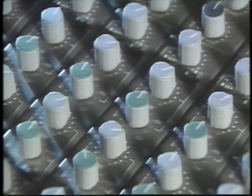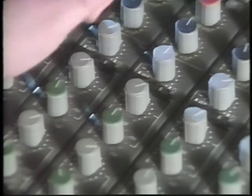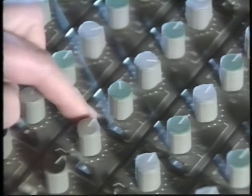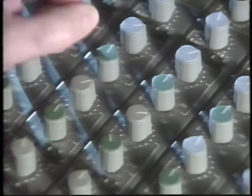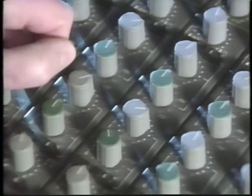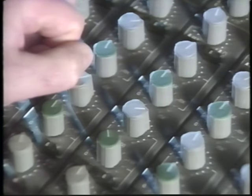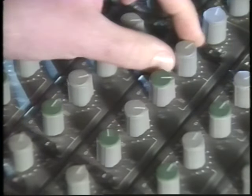We have a row of six rotary potentiometers, commonly known as knobs. At the top, a high frequency control — a 10k boost and cut — responsible for the very high sibilant sort of sounds like your hi-hat. The bottom knob is for the low bass frequencies, switchable from 60 Hz to 120 Hz. The mid-range controls are in pairs of two: the top two for the upper middle register, and the other two are a frequency cut and boost for the low end. The advantage of having this section in what they call parametric pairs is that if there's a part of a sound frequency you don't need, you turn this frequency control until you find the offending harmonic or hum, and then simply use the cut and boost control to get rid of it.